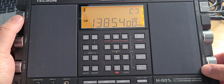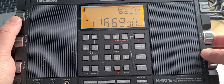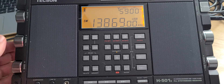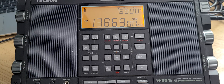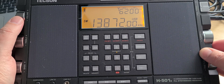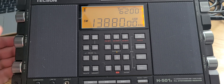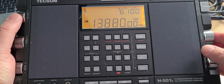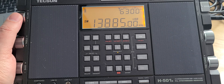For the rest, let's tune around mostly in upper sideband for utility content. Here's a radio teletype-style signal. This is registered as the US Navy STANAG frequency on the west coast of North America. Around 13,881 or 13,880 you might hear some weather fax coming out of Pinneberg, Germany, which often comes in here on the east coast. Here's a very weird, extremely bizarre signal.